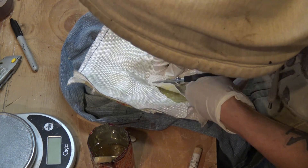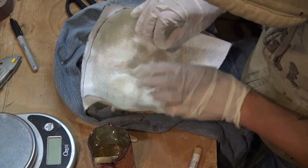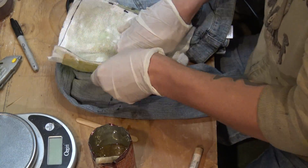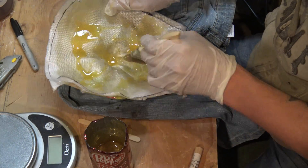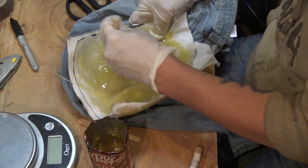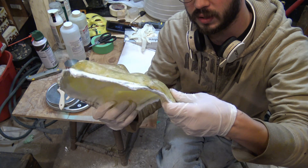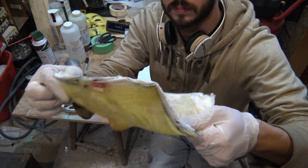The resin was very thick partly because of the cold. Getting the correct temperature when curing resins is very critical. I applied ply after ply — initially six layers with six ounces of resin, then a second lamination of four layers with about five ounces, then the next day five more layers with four ounces. In each instance I didn't use all the resin. The total came to 15 layers of Spectra fabric. I broke it up because I wanted to make sure it would conform to all the shapes and have fewer air pocket problems.